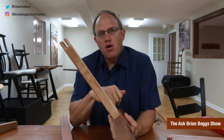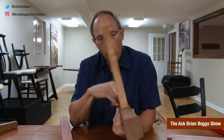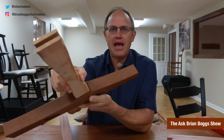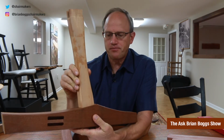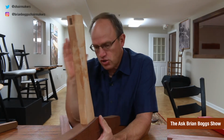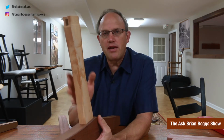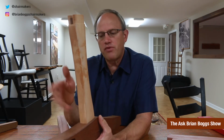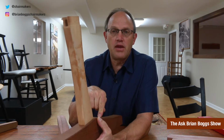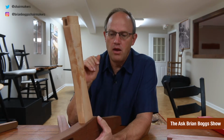So these tenons are actually, when buried, slightly larger than the hole. I don't know if you can see that very well, but that seam is absolutely airtight. These joints were cut 7 years apart, and I just went down and grabbed these parts and put them together. Now, one thing that means is that when this was cut, it was probably the same moisture content that it is now, even though it certainly would have fluctuated up and down between now and then.